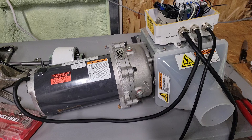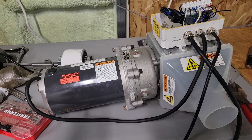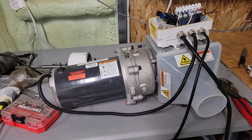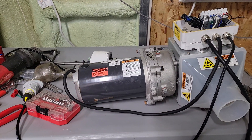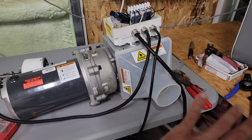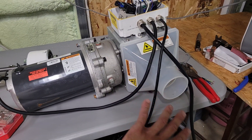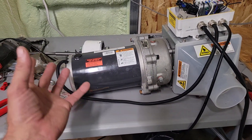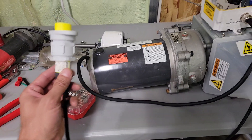The whole setup was about three grand with shipping, and then I got my grain bin which was a couple grand as well. Overall it's going to make things way more efficient — we're going to flip a switch and this will auger into a screen first, and then the screen will clean out any debris. Then that'll go into the bin, and the bin will measure it out by volume using this sensor.